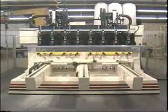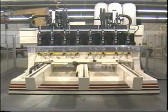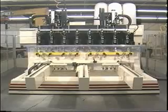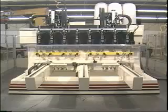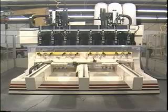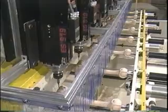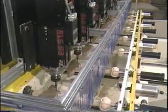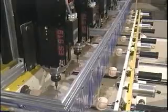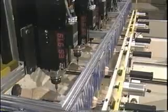The Model 80 is the result of over 10 years of experience with CNC carving. It's a rugged engineered steel structure that uses trackways and precision linear bearings. State-of-the-art digital servo AC brushless servo motors power the machine axes. It has eight 10-horsepower router spindles with variable speeds up to 22,000 RPMs. Up to eight different tools can be used in production with completely automatic tool changes.